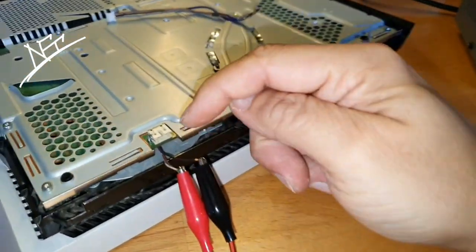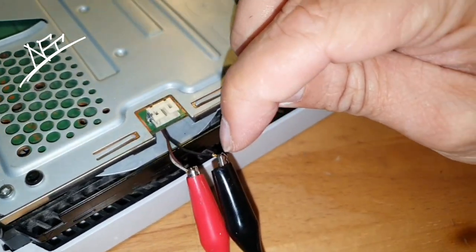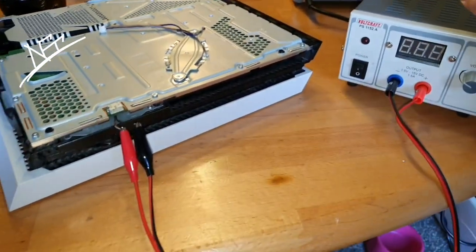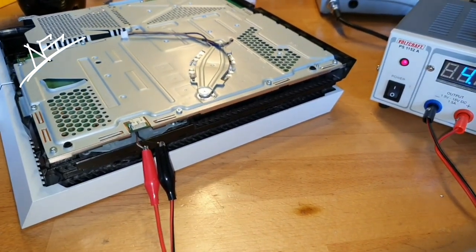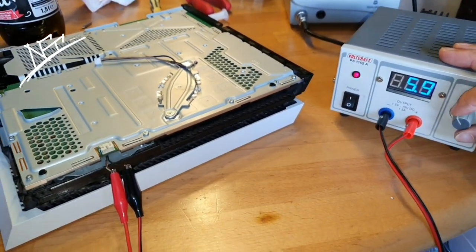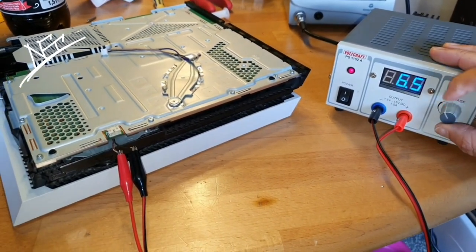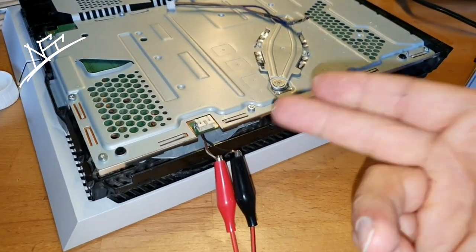Let's test the fan if it's working or not. You can see I got the brown one and the gray one together with plus, and the black one here just on the black one. Here I got my small PSU. I think I have set it about on four or five volts. And now let's just test it — take care that these two contacts don't get together. And here we go. Yeah, it looks good. So I can keep now my work and we can say for sure that the fan is really working.